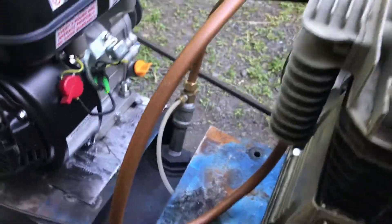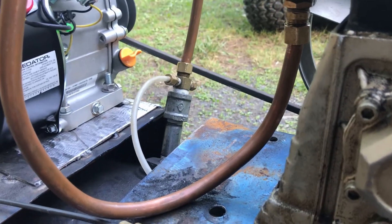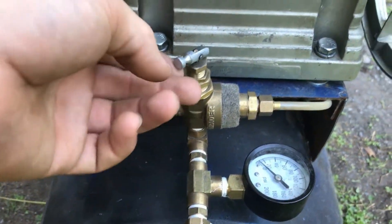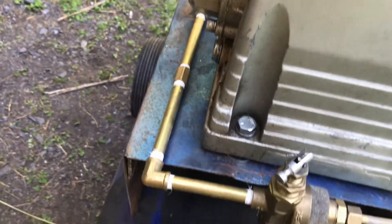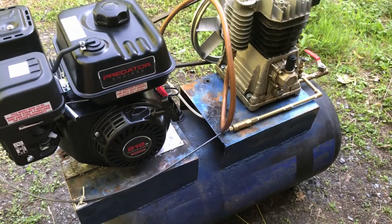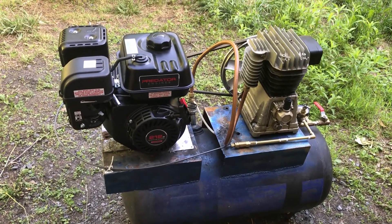The air comes out of the pump and goes into this one-way valve. This one-way valve only lets air into the tank and not back out. This right here tells the pressure inside, and it sends that pressure over to the unloader valve right here. When this is in the down position, it means the compressor is loaded so it can start compressing air. What happens is when it gets to a certain pressure it pops this unloader valve and sends the signal via this bullwhip throttle control. It's got a throttle cable that hooks up into the throttle, and then it idles the engine and releases the air that the engine's putting out at idle until it needs more air, and then it throttles the engine back up. So that's a quick tutorial of how the bullwhip throttle and unloader works for a gasoline engine air compressor.